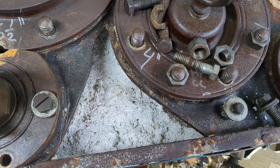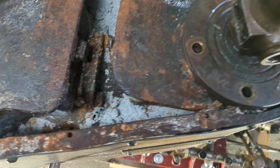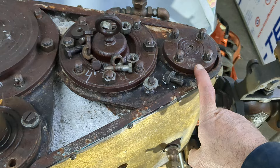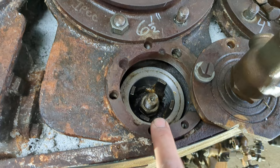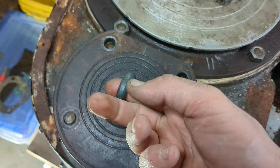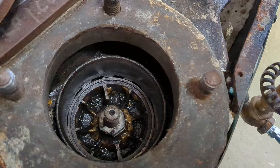I discovered that the cylinders are each individual castings that have flanges cast in them, and they're bolted onto the neck. It's inside admission on the HP, inside admission on the intermediate pressure, and then outside admission on the low pressure. You can see the ports coming from the low pressure through this receiver here — that's steam from the intermediate pressure into the low pressure.